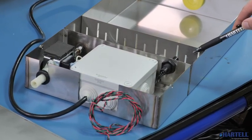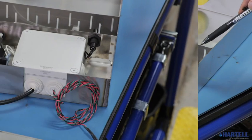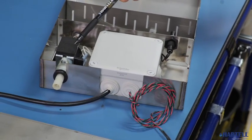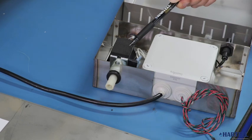The debris filter's unique design maximizes the time between maintenance by limiting large particles from leaving the tank area. All models of Hartel's HCP range are fitted with an impressive positive displacement pump that provides 105 feet or 30 meters pumping head, that can also pump over 300 feet or 90 meters horizontally, depending on the vertical lift.